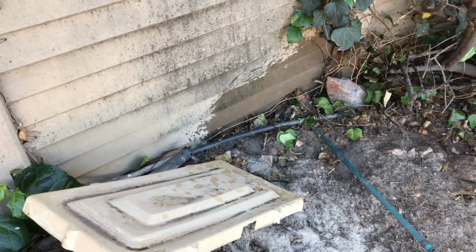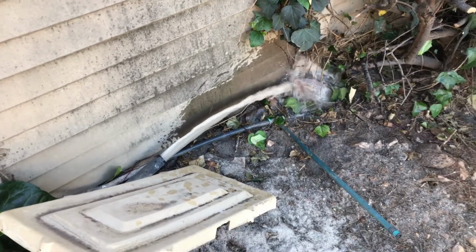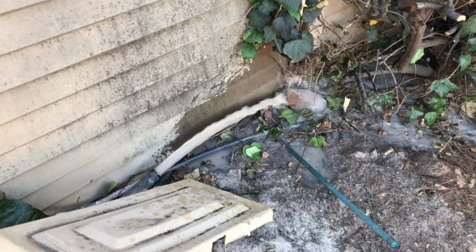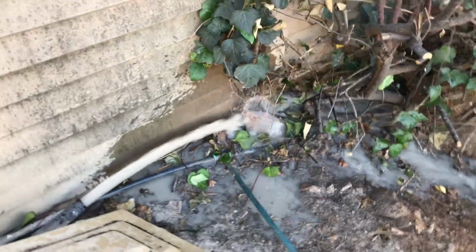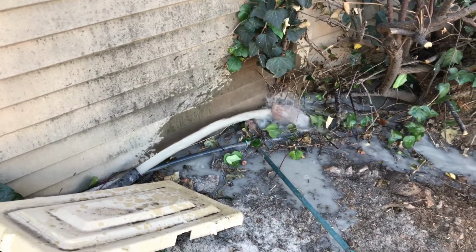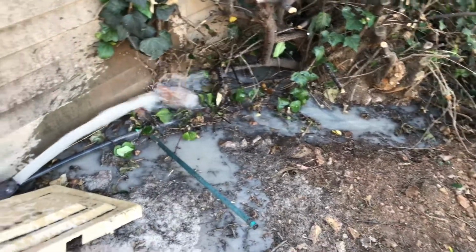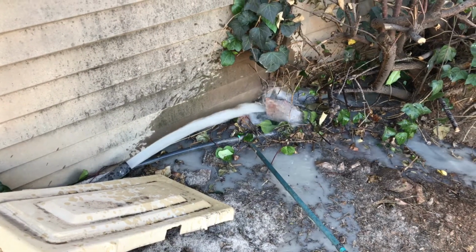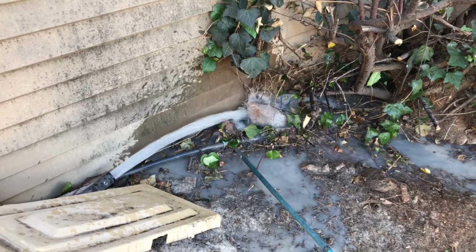And the right way to backwash is to see that that water goes completely clean. You can see it's very brown and dirty because it's been sitting for so long. But you don't give it a time. Everybody's like, yeah, you should wait 30 seconds or a minute or whatever. You let that thing run, at least what you're supposed to do is let it run until that water is clear. You can see it's already clearing up. This has been off for about a month. So you gotta leave it to run clear.